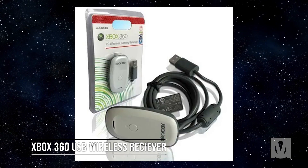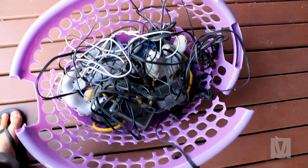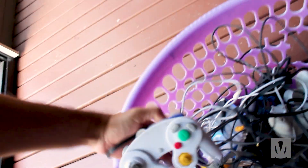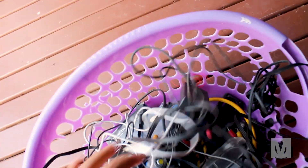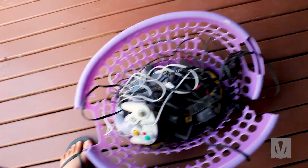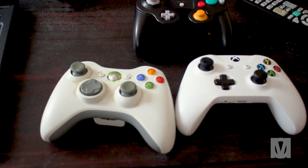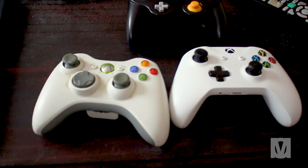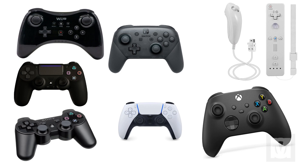I also purchased the Xbox wireless receiver quite a number of years ago, and it's still available to purchase. I got the GameCube controller wiring straight from an old controller that didn't work — it was from a fake controller. I needed the male end of the GameCube controller so that my Arduino can connect to the actual GameCube. Now, if you don't want to use an Xbox 360 controller, the USB Host Shield library also allows you to connect other controllers via a Bluetooth USB dongle — for example, a DualShock 4 controller as pictured above. You could easily simplify my code to support that type of controller.